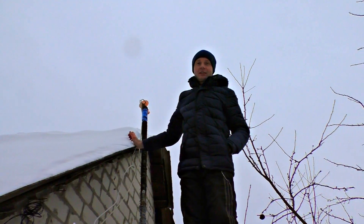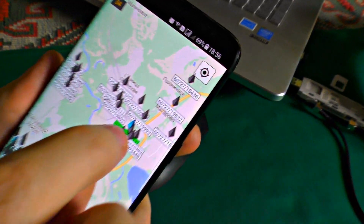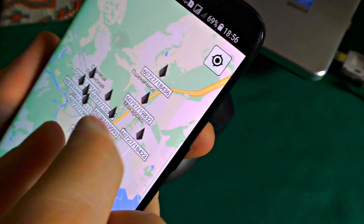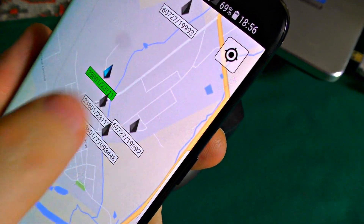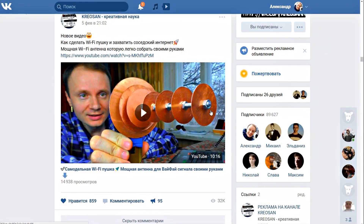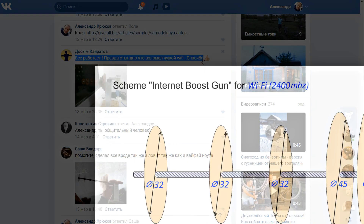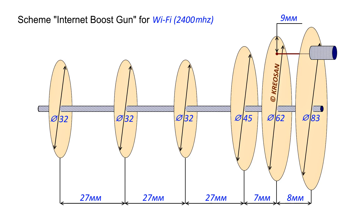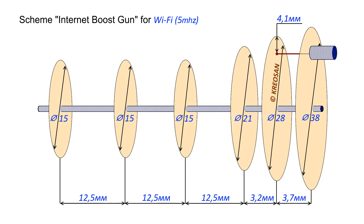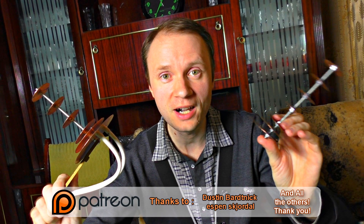To reach maximum speed, try different places for your antenna — different edges of your rooftop, etc. To find your base station, I recommend the NetMonitor app — it will help you find it. There may be numerous stations. If this antenna doesn't work for some reason, send us some photos on the wiki and we'll try to help. Look in the description — there is an ultimate Wi-Fi gun scheme and a new 5 GHz Wi-Fi one too. See the previous video to find out how much the Wi-Fi gun can boost your internet.